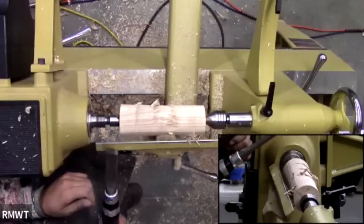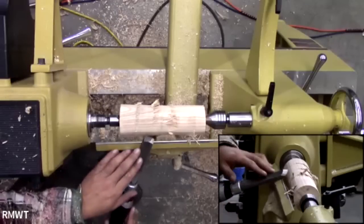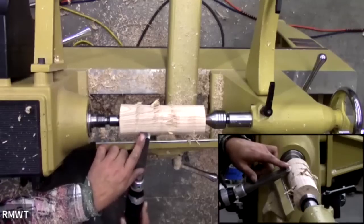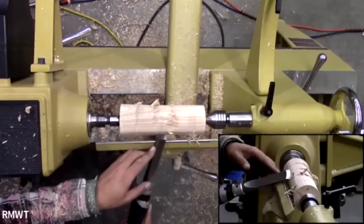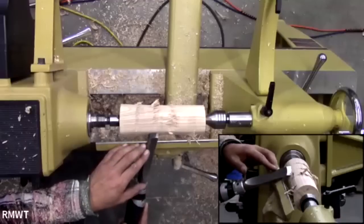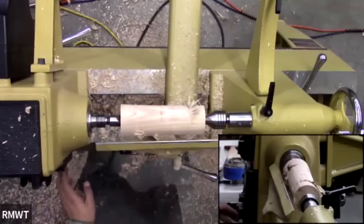So that should then call for advocating for a certain area of the skew to be used properly. And so what you kind of have to do is find a sweet spot, and the sweet spot is just a place where you're not over rotating, you're not drifting too much with that unsupported edge away from the cut, and you're not pushing the cutting edge or the point forward too greatly that you're digging in on the other side. Far greater is it to dig in on the other side forward, but then obviously these results right here are no good. So let's go ahead and fix this.